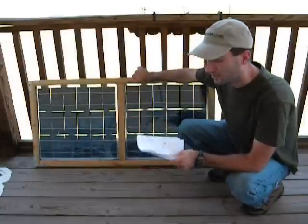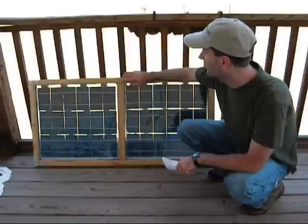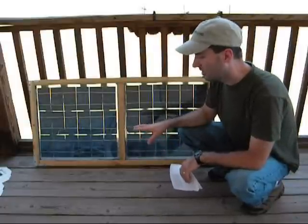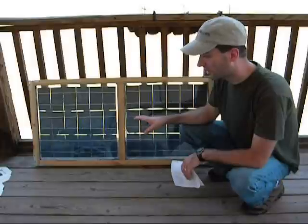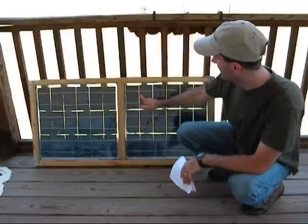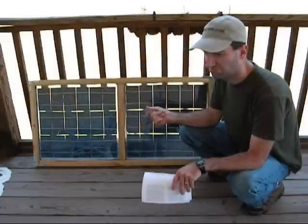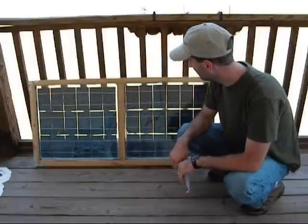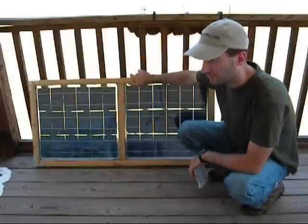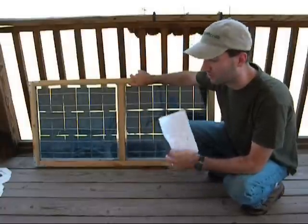I did want to mention — I had one of the subscribers ask, would I make this again? Absolutely. I don't plan on buying any more solar panels; I just plan on buying solar cells and making my own. It's so cheap to make them and pretty quick. I can make one of these in about two days, so they're not that time consuming. The longest thing is definitely putting in the tabbing wire on the cells, but once you do even a strip you get a nice rhythm and can just crank them out. I do plan on making a whole bunch of these and making wind turbines, and hopefully eventually being completely off the grid — maybe even selling some back to the power company down the road.